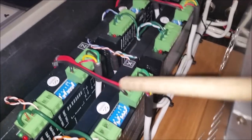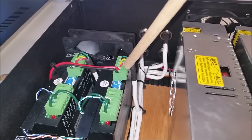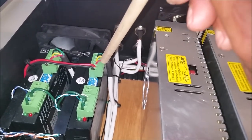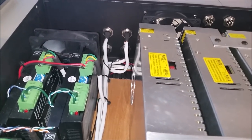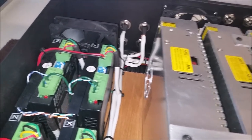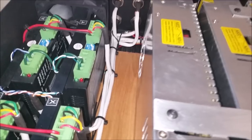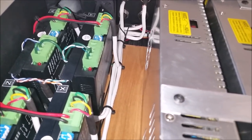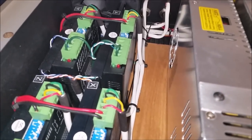All the stepper drivers are obviously marked. This is just common wiring — Ugra sells it but they sell it by the foot. I went on eBay and found a roll of 500 feet for about 60 bucks, so it was enough to wire this whole machine. I could probably do another three or four machines with it. If you order by the foot and your harnesses are too short, you're kind of out of luck — that's wasted money.